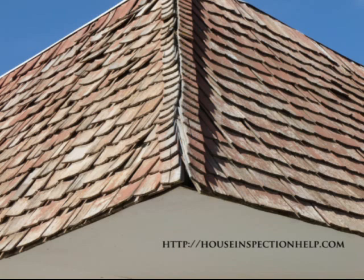Something like this could be a big problem and would need to be fixed as soon as possible. I would actually recommend, in a situation like this, replacing the entire roof. The rest of the shingles I can see are starting to cup and warp — it is time for a new roof. You could go and replace all the individual cedar shingles that are damaged and the hip shingles, but realistically a full replacement is better.